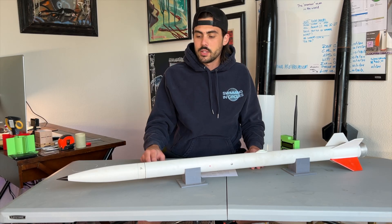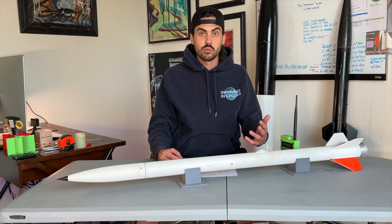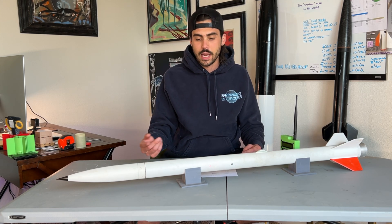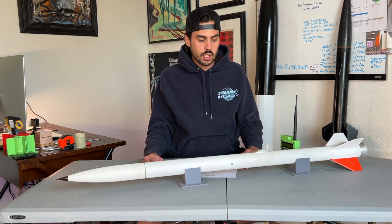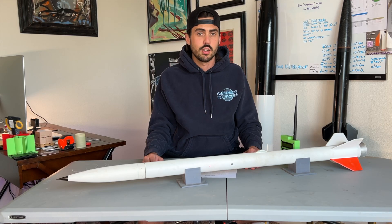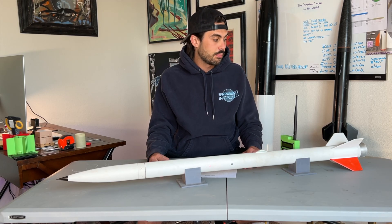I'm a big fan of the Quasar. This isn't dual redundant electronics — there's just one flight computer, the Quasar — but what I like is that auxiliary channel you can program as a backup main, backup drogue, second stage ignition, and more. I have it set as a backup drogue, firing one second after apogee, and everything fired and worked great. One thing I also noticed was definitely a difference between a completely fiberglass rocket and my cardboard rockets. This thing is just very solid. You can tell when it hits the ground, it's solid. Nothing is flexing. The tip-to-tip fiberglass layup on the fins makes them very stout, and for anything high performance I'll be doing tip-to-tip just because of the stiffness it gives the fins — it's unbeatable. Even if it came in without a drogue, I'm not concerned about the fins being damaged unless it hit a rock. It's a very solid build and I'm excited to fly it on some bigger 54mm motors.